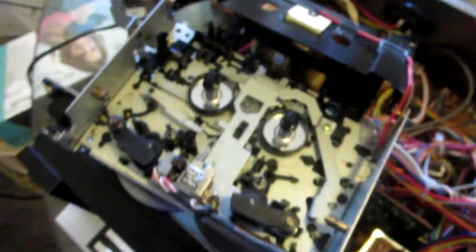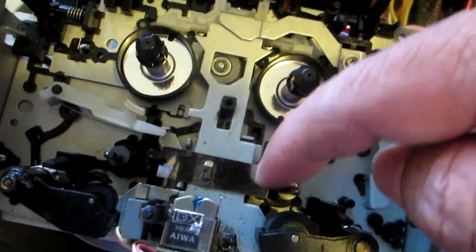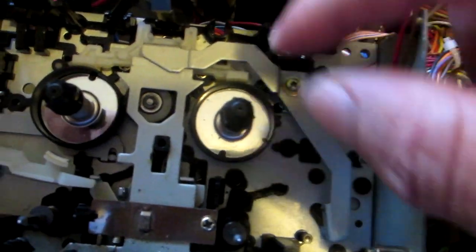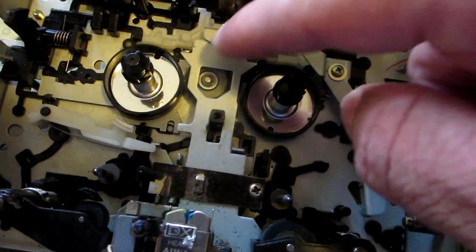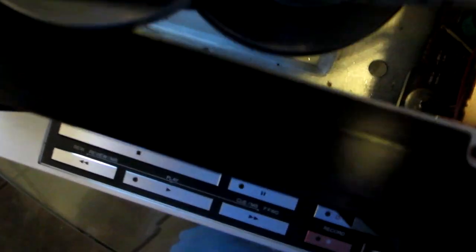A little correction: in order to move this plate out of the way, the first thing you want to do is remove this screw and this plate, and then the second thing is to remove this screw at this plate right here. It's going to move much more easily. This one goes at the bottom and this one goes on top — now it's nice and secure.